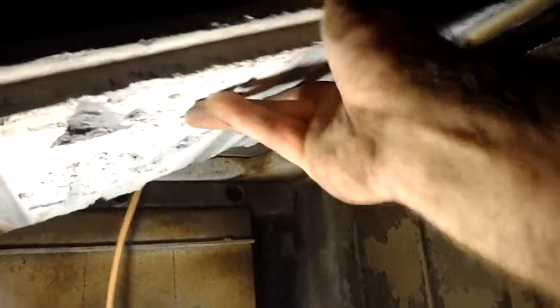So to remove the sealant, it's a little trickier, but once the sealant comes out, you notice you're seeing a bunch of creosote. There it goes, a bunch of it just fell down inside there. This is one of the pieces of the sealant. You're going to have to remove that, and you're going to have to remove the other pieces. The bigger one's always a little trickier.